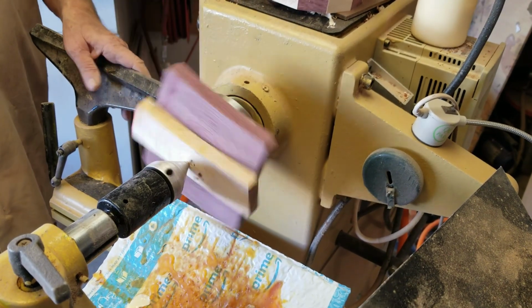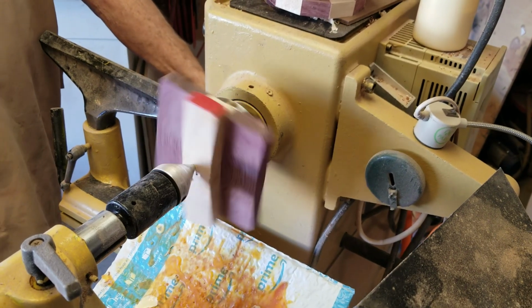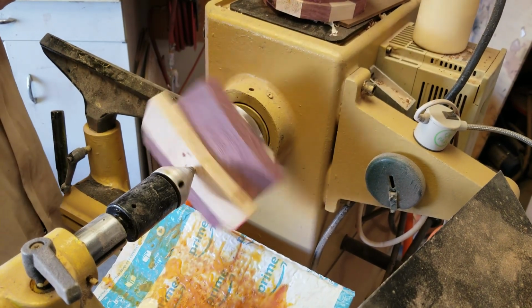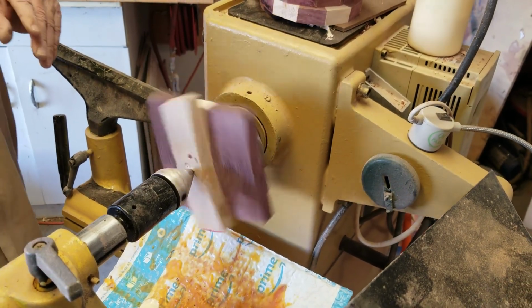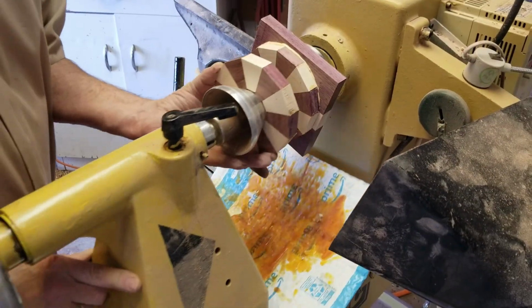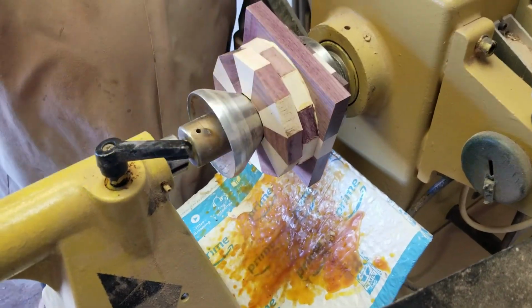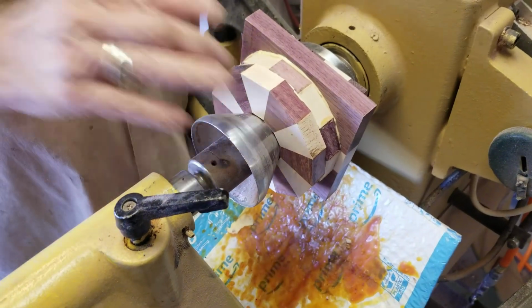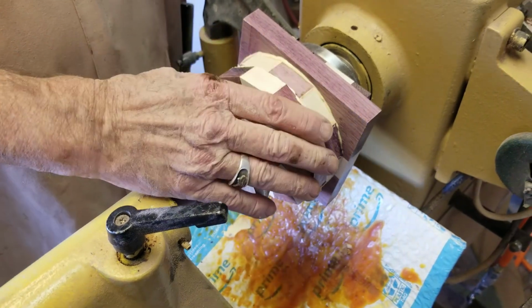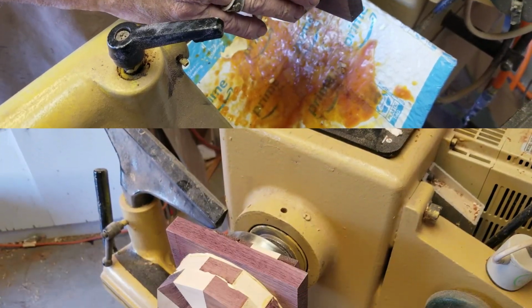And as long as that tip isn't doing this fishy thing like it's swimming upstream, then you know it's square. And with that piece of wood on there, it obviously distributes the pressure that I used this tailstock for. Correct. To put more pressure on it, yeah. This here is where you do your alignment. Make sure it's okay there. If you have this too tight, it will sometimes cause this here to move when you're trying to turn it. So you have to be aware of that.